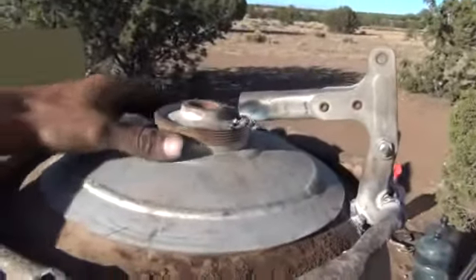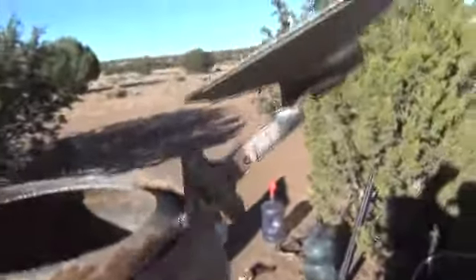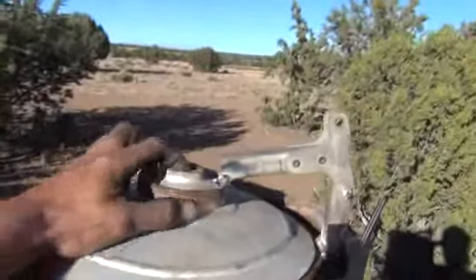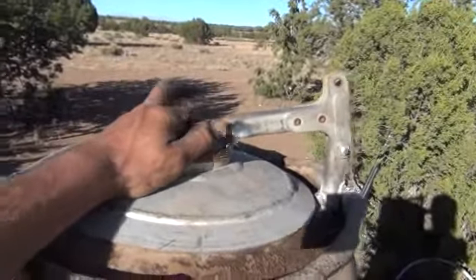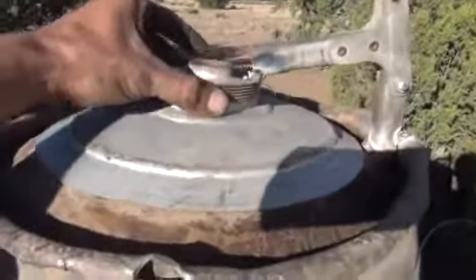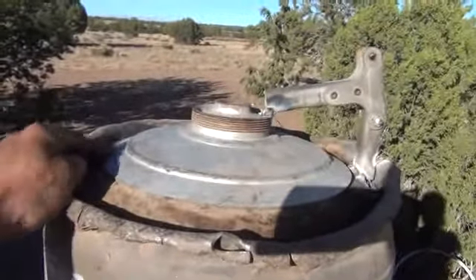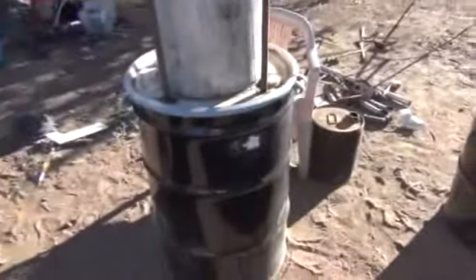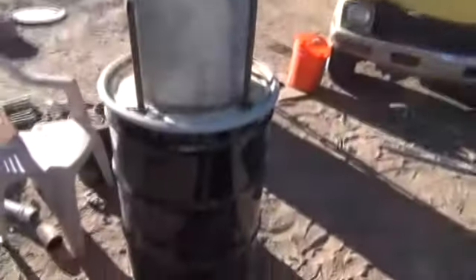Here's our hinged top — it's fully hinged and rocks all the way back, keeping itself open. The only thing left is to add a spring on the other side. The lid seals nice and tight on top; I still need to add a pressure system and a CO2 input from the exhaust into the upper hole. We're basically a sealed chamber now: we've got our ash dump, our air intake pipes, everything ready except the output pipe. Once that's in, we'll hook up the fan and see how well this thing works.